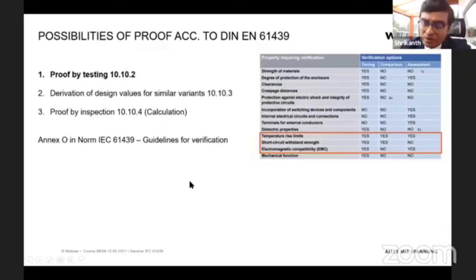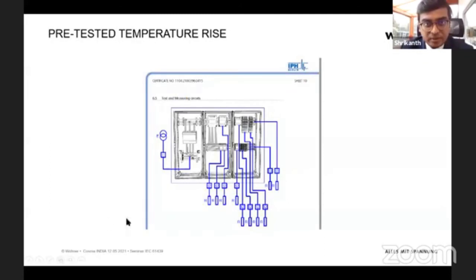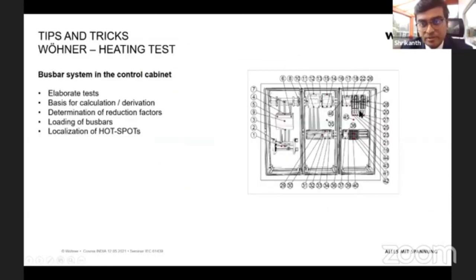So what we have also done for this temperature rise test, with the same lab here, you can see, we have made a combination. We have made the temperature rise test already for you. That means we have made, these are the clamps and cable joint with flexible bus bar with direct bus bars. And this is the load attached. This is the report, a screenshot from the report. And here are the temperature measurements that we have already done.